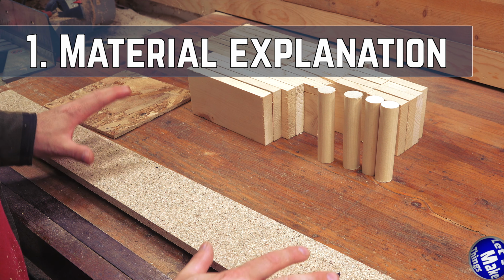Now at this point, you want to make sure that the hole that you drill out here in your router plate is going to be a little bit larger than the planing bit that you'll use in your router. This is a 2-inch planing bit, so I'm going to go up to a 2 1/8 inch Forstner bit. If you don't have a Forstner bit that's large enough, you can always just cut it out by using a chisel. This is a 1/4 inch. It should be very easy to cut through.